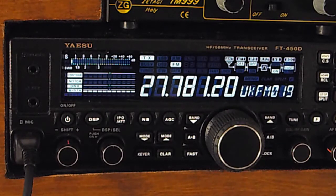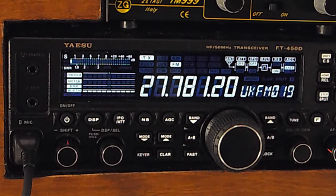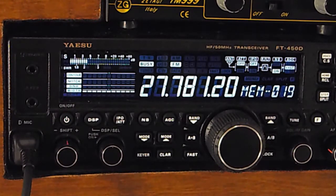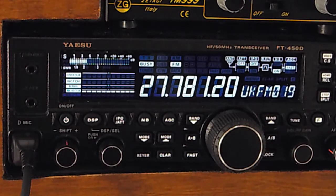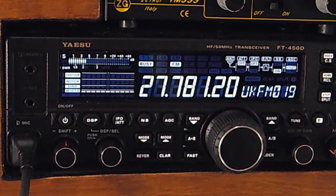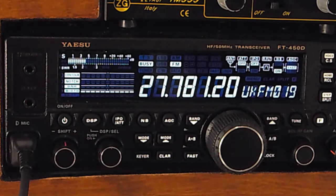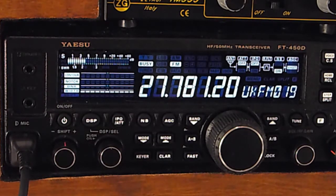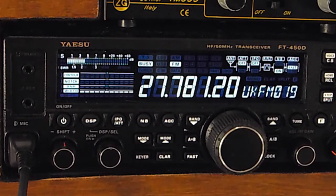Roger Dave, yeah we've got all that on camera. I know it's a Cobra 148 - what is the exact model? Yeah, it's the 148 GTLDX Mark II. It's got the PBO10 board in it, so it's got the MC145106 chip - you can modify them better than you can with the Mark Ones, which have a different board in there.